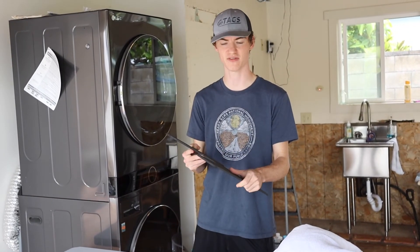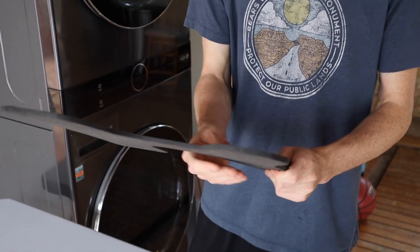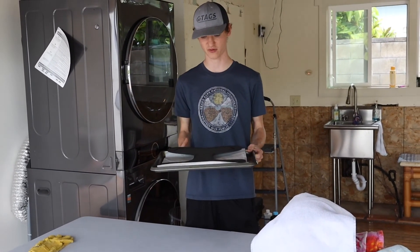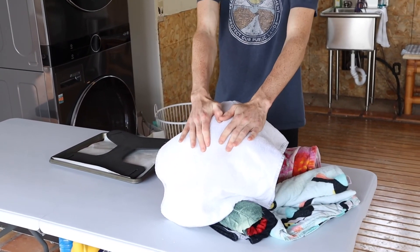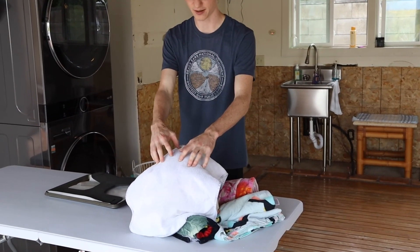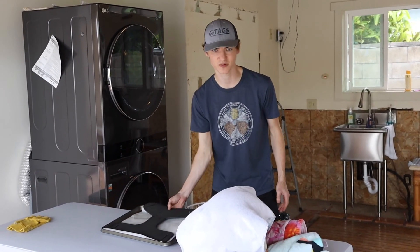I've roughed up this piece of ABS pretty coarsely — it's rough to the touch — and I made sure to go around all the edges so the epoxy and fiberglass will want to stick. I have a baking sheet with baker's paper and I'll set this on it. The oven is preheated at 350 degrees and I'll put it in for 5 minutes. I've also prepared the cast with some pieces of towel to act like the foam we'll add between the sheet and the harness, so it won't be too tight a fit when put on the animal.